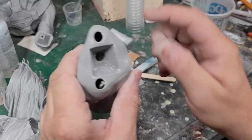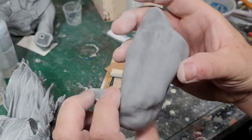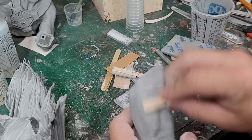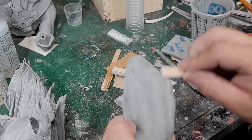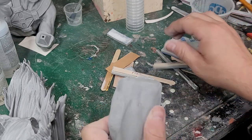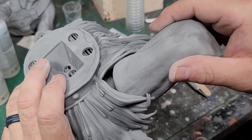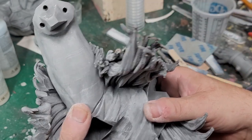This part is supported right here — this is the build plate side. As it goes up and down and releases from the FEP sheet, it might shift a little bit, so I get those lines in the print too. I don't really know how to reduce those. On the last print I did for a client I used really slow settings and everything, but the base turned out with a ton of print lines I had to take care of because it was so big — huge cross section, huge suction forces. I'm not sure personally how to prevent that, but I'm hoping primer is going to take care of it.